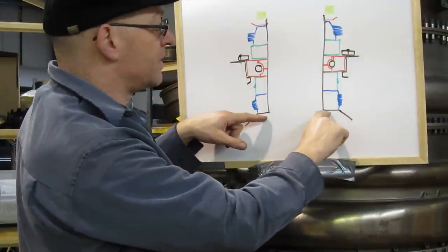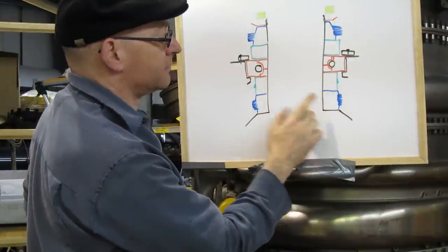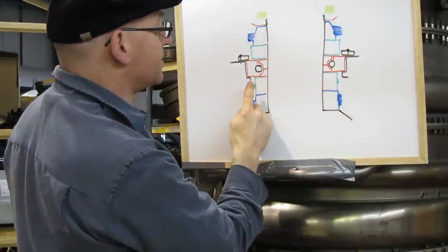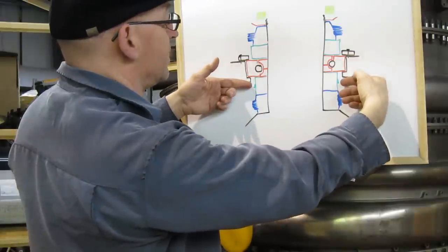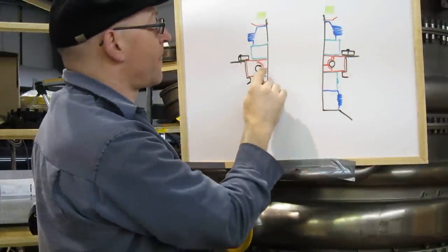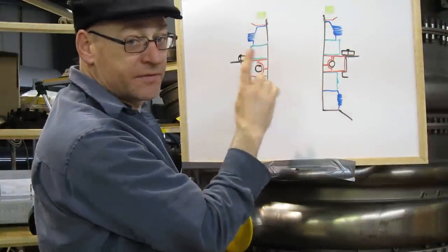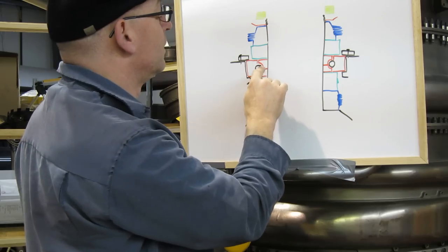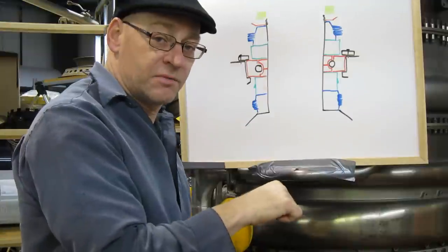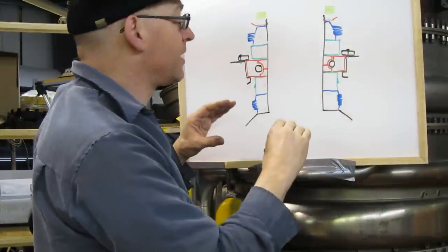There's a shoulder on the rear of the compressor. The first thing is a rotating air seal, then there's a rotating carbon seal race which has a carbon seal that attaches up in here. Then what's stacked on top is the forward and then the rear inner races of the thrust bearing, which you've seen me install in the thrust bearing videos. All of these things have to be heated and slipped on, and they're also compressed on with that special tool when they're cooling to make sure all the clearance is taken up.